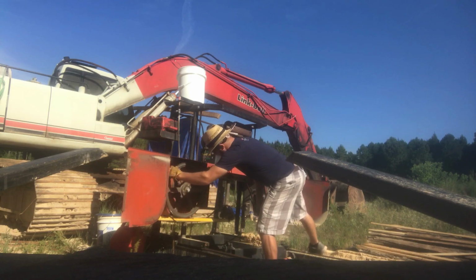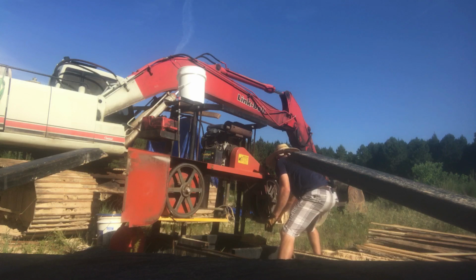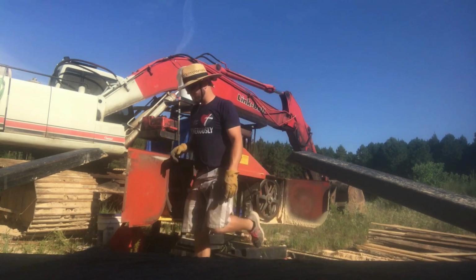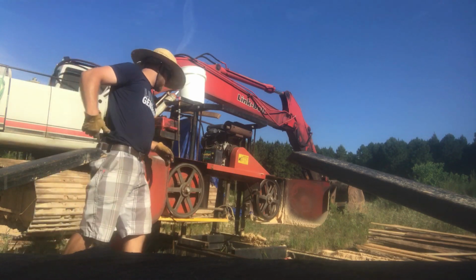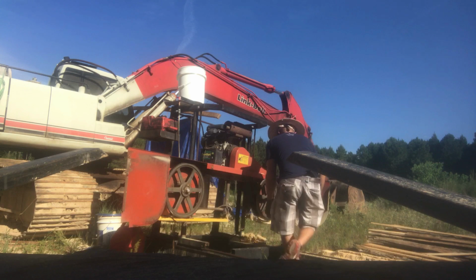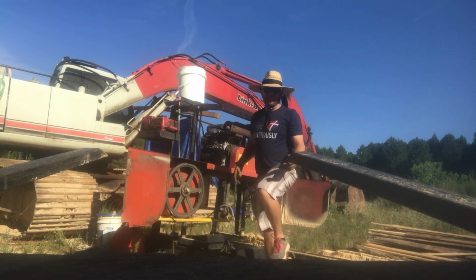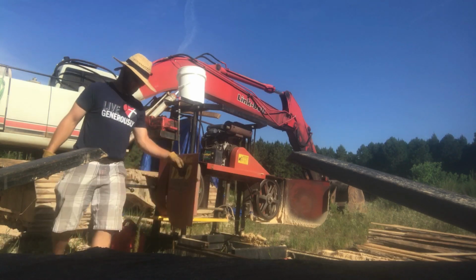And you definitely always want to wear gloves, because even careful as you think you are, these suckers are sharp. So I'll get it kind of loosely lined up. I don't remember, there's some rule of thumb about the back of the blade being an 1/8 inch onto the wheel or something. I just kind of make sure the teeth are all sticking off the front. And then I'll tighten it up just a little bit to make sure that it's holding. And then I'll go and adjust it again, just to make sure nothing's in a bind. Make sure it's not hanging up on a shield or anything up top. Sometimes it'll get snagged on a little clip up top. And again, that may just be my machine. Once that's done, bingo, you're ready to saw.